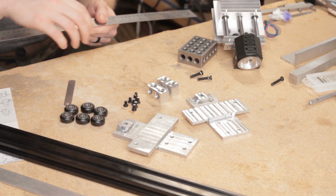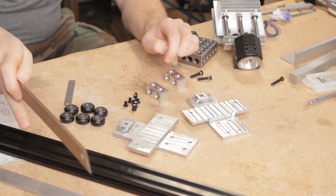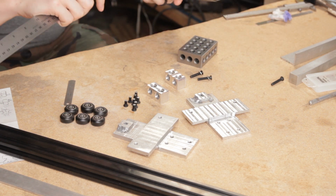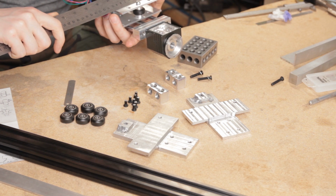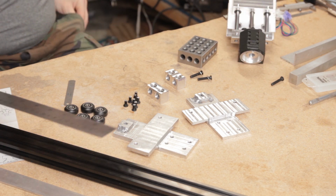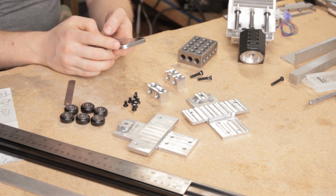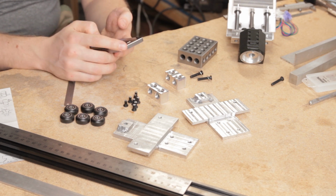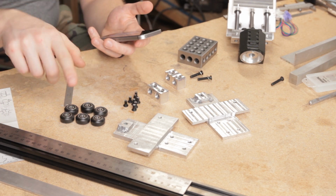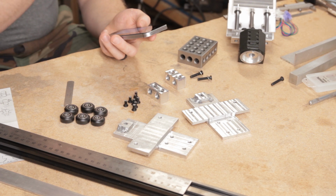So I made these brackets to be about 20 millimeters wide, so I'm going to run with that for them. Obviously the extrusion, being 40-20, is 20 millimeters thick, and the carriage looks like 97 millimeters wide. So if we add all of that together, we'll want 12 inches, so 12 times 25.4, 304.8, plus 97 plus 80, so that's two brackets, two extrusions on each side for 80 millimeters. We get 481.8, or just over 48 centimeters,